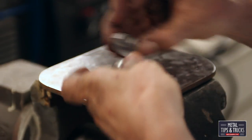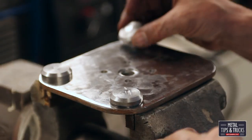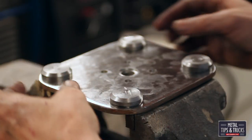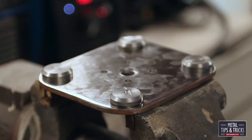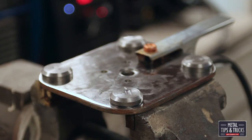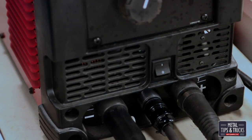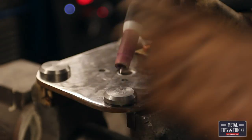Next we're going to go to the welding process. We're going to weld these feet onto the base. I didn't do a lot of cleanup — we're going to TIG weld these so we don't have a big weld bead, and we're also not going to use any filler rod. You can see the oil on my hands because I came straight over from the lathe. No wasting time in fabrication — remember, this is not machining, this is fabricating. We've got the Lincoln TIG 200 square wave.